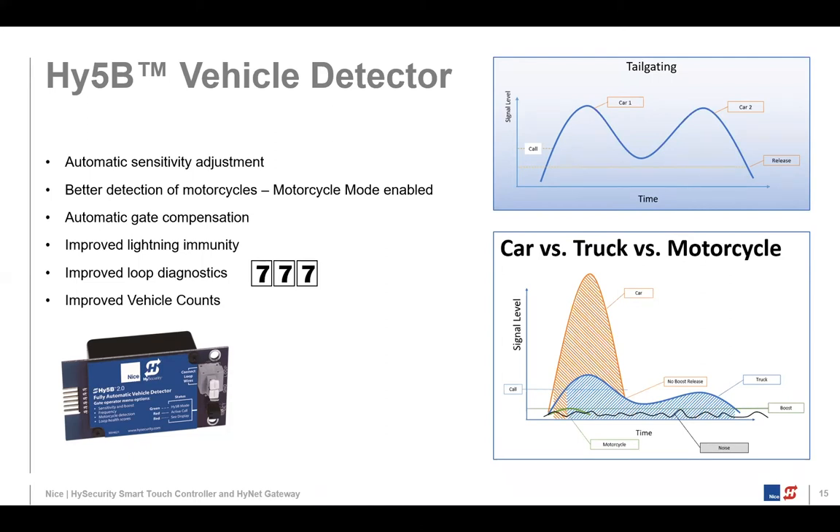Interestingly, a car being lower to the ground provides the highest signal on a loop detector, while a truck with high clearance provides a much weaker signal, and the motorcycle signal can be down near the noise floor. In our download history log — those 320 entries — every midnight, we reset the loop diagnostics counter, which starts at 777. As it goes through the day and things change, you'll see those numbers change, which can really help you determine if there are noise issues or a bad loop. That helps you troubleshoot any loop issues.